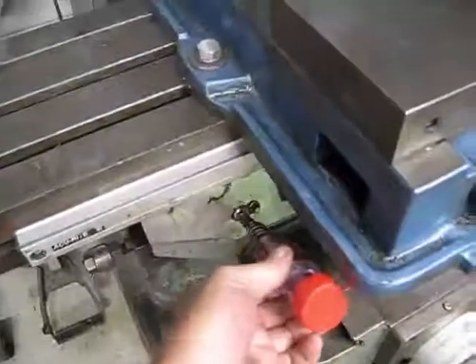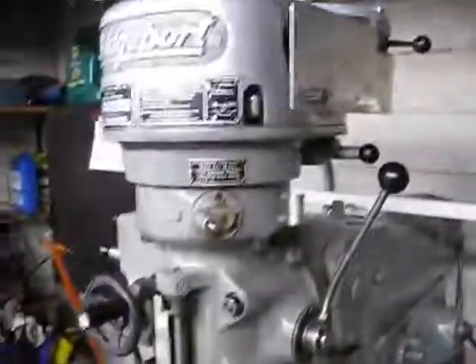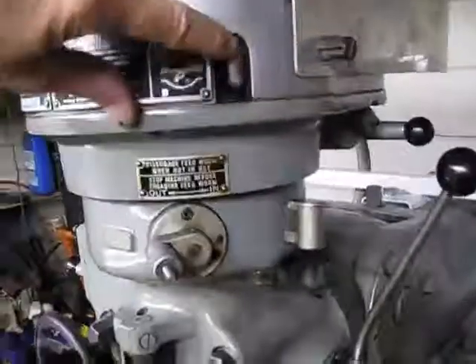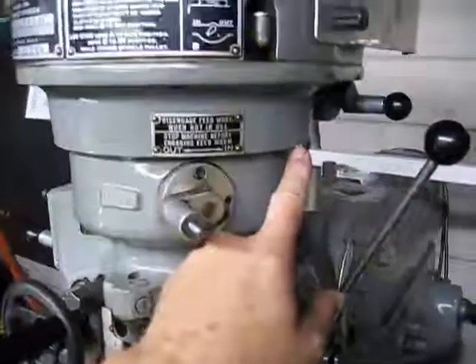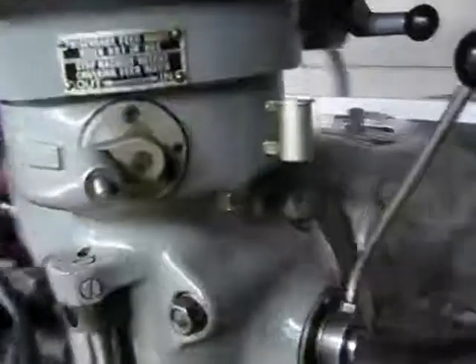Put this on here and then you can pump the oil in like that. There are oil spots here and here and over there and over there. The spindle oil goes in here, and then just the other medium heavy type oil goes in here. So that's it.